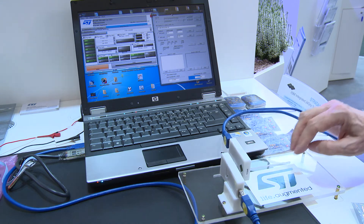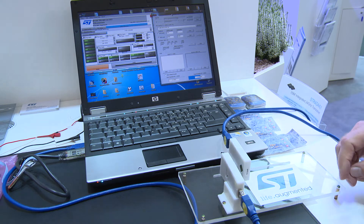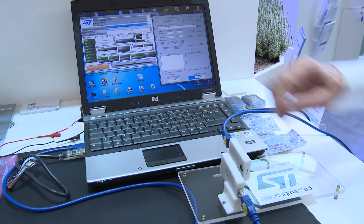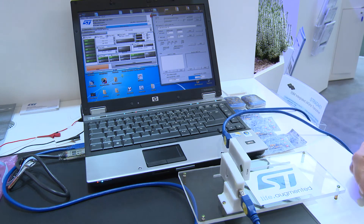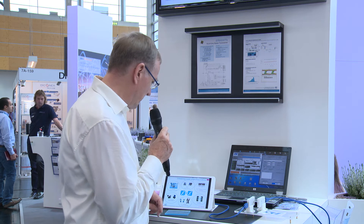If I go back, the communication is resumed. We are going back to two gigabits. In this assembly we can achieve two gigabit communication. The limitation comes from the FPGAs and the transmission cables in here, but SparkLink can go up to six gigabits per second.